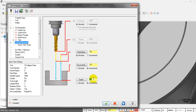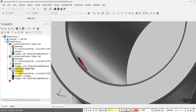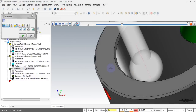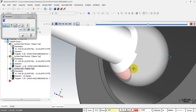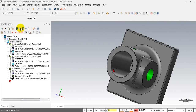Set the depth and, since the tool diameter is 10, I will include this value accordingly. Let's check it — the tool plunges. We need a small lead-in here, so add a lead-in of about 1 to 2 millimeters. Check from the top. You can see the tool enters and creates a small chamfer. If this creates too big a chamfer, you can shorten the toolpath. Now let's do a simulation to verify what we've done.